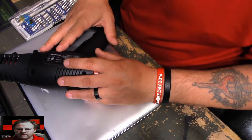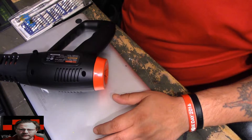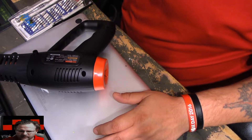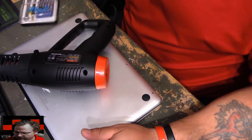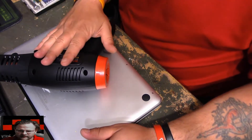I'm working on a MacBook that has some video problems. A lot of times this is because of the solder points being broken. Over time, heat builds up and softens the solder points and they end up breaking. So I'm going to attempt to fix the video problem with this one by using a heat gun.